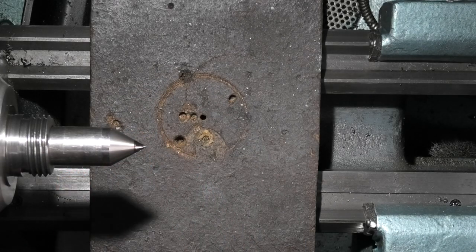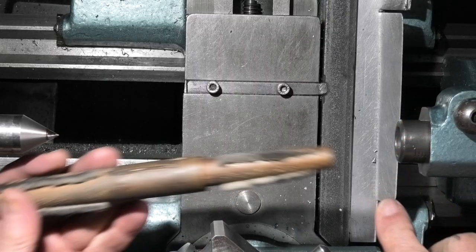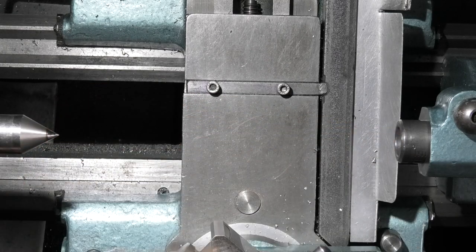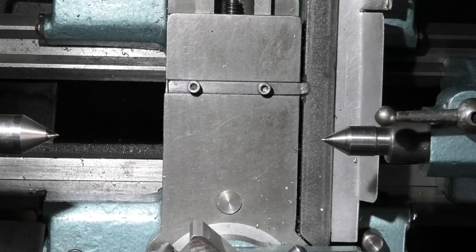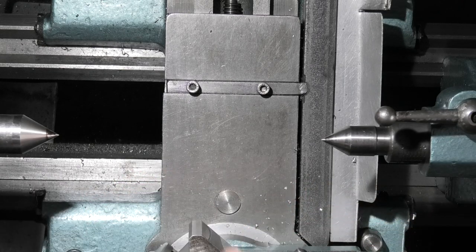This end's finished — move on to the other end. On the tailstock, clean the morse taper, and then on this end I'm fitting another centre, so I have a centre on each end, and then I'll use my test bar — the bar that has a centre drill hole in each end.